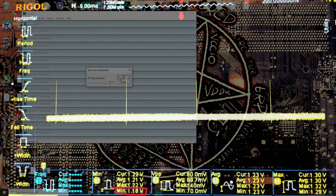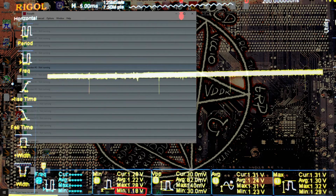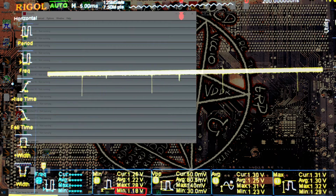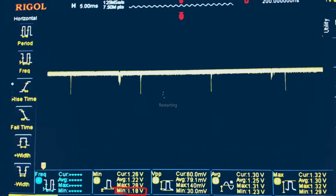But the good news is, running the VRM at a lower switching frequency reduces how much heat the VRM produces, and if you're also getting the best voltage regulation that the motherboard can deliver, that's a win in my opinion, right? I don't really see the downsides to that.